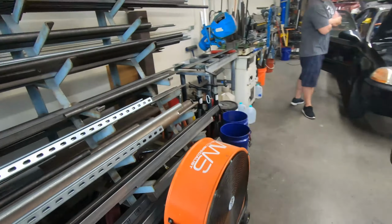And guys, what Owen and Ed were doing, they're basically prepping all the surfaces. Before you start welding, you want a nice clean surface. And to ensure that, you gotta get rid of any rust that might be on the metal, any paint, stuff like that, so you get raw metal to metal contact. And that's pretty much what they're doing, just cleaning it all up. It's all in the prep. If you want good welds, you gotta have good prep.